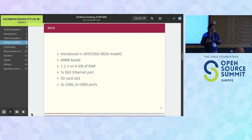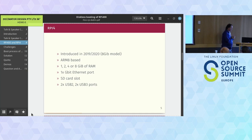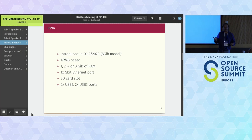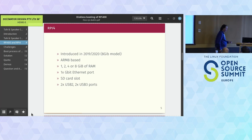I really love these Raspberry Pis in a Kubernetes environment - what would be greater than having a Kubernetes cluster you can just switch on and add new nodes as Raspberry Pi modules. It has a 1GB Ethernet port, an SD card slot, two USB 3 ports. The SD card is actually the Achilles heel - continuous writing for Kubernetes will completely wear it out.